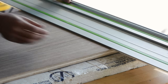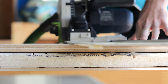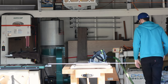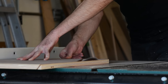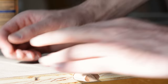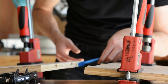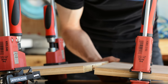One of the problems that I ran into was that the bottom piece of my cabinet, which is about 55 or 56 inches long, is actually more than my table saw can handle. So to solve this, I cut the bottom piece in half, made the bevel cuts, and then glued it back together. You're never going to know that I cut the bottom piece in half unless you were looking at the finished piece from the back, the underside, or the inside after removing the bottom drawer box. So pretty much unless you share your dirty little secrets on YouTube, you're the only one who's ever going to know.